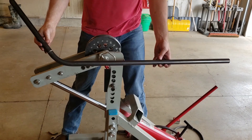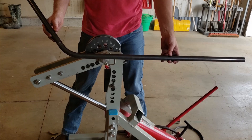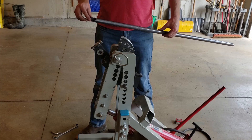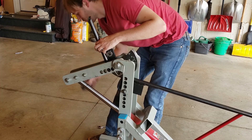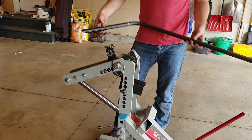There's our tube — we had to bend this one to 56 degrees and we were able to do that in one shot. When this sits in the frame it will sit at an angle about like that. The final piece of the frame — we're going to clock it just like the other one. We've got this special notch, and having the ability to clock these things to the exact angle is going to be really helpful. Same thing as the other one — we got that 56-degree bend in there and that piece will sit on the other side right about like that.